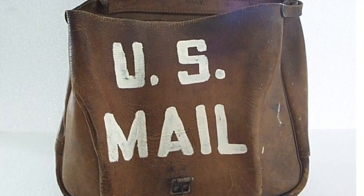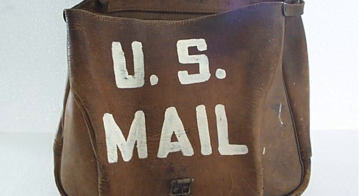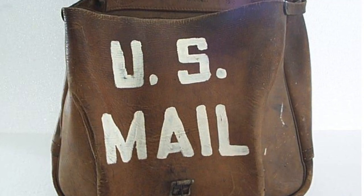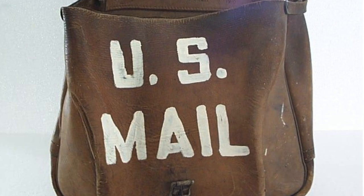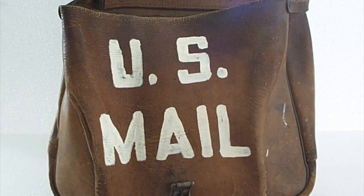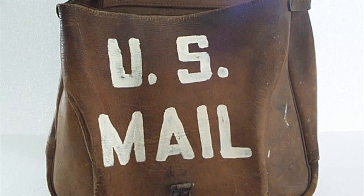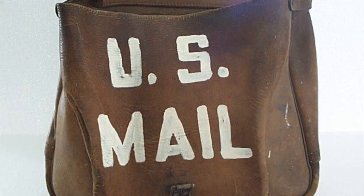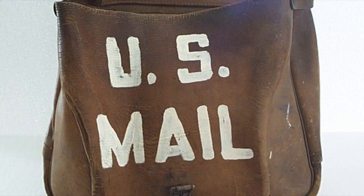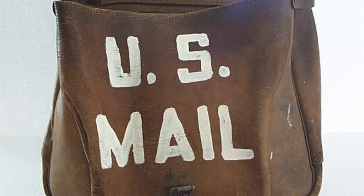One of the bigger ones is a setup for a bilge pump. In addition to his video, Gerald said: Hi Jerry, I quickly made this video to send. This one is of my bilge pump. Having a pump on your boat is a must when you're in larger bodies of water, and when it gets rough and choppy, or even if someone goes too close to you fast and sends a good-sized wake your way while in choppy water. I said in the video that I got the black tubing from Walmart, but failed to say it is only found on their online store. Also, I simply capped the ends of the tubing while making the bends with the sand inside with masking tape.